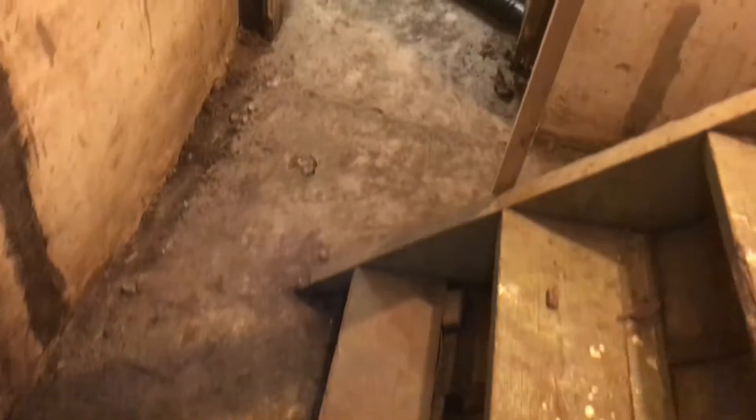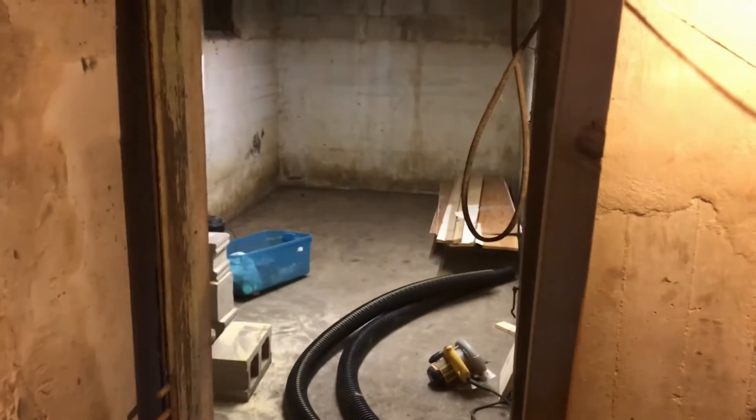It's probably not going to show great light in here, but we've got a rock foundation. We're going to cut right around the edge of it, put that drain tile in there, and then in the back corner we're going to put a sump pump.